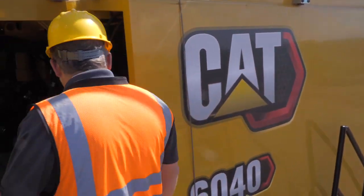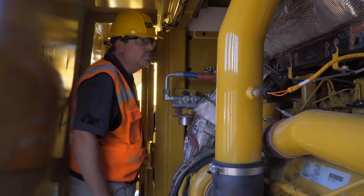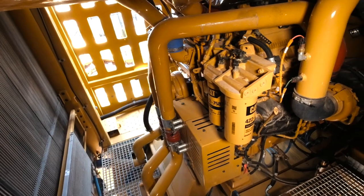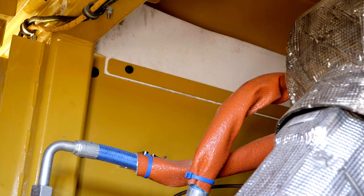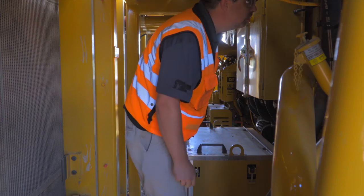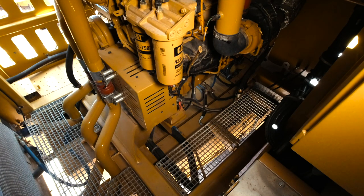If we take the first entrance to the right, we enter into the engine module, where our twin C32 engines are located. To meet global emissions regulations, we offer two configurations. These engines meet U.S. EPA Tier 4 Final and EU Stage 5 emission requirements with a maintenance-free after-treatment system. This is a non-DEF solution which saves money and reduces downtime. The 6040 has improved sealing between engines and hydraulic compartment, improved routing and separation of hydraulic lines and electrical cables, new pressure relief tanks, and protective heat covers on exhaust and turbo pipes. There is also plenty of space around the engines to provide access from three sides.